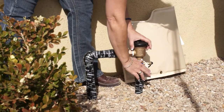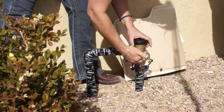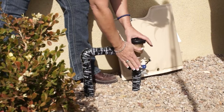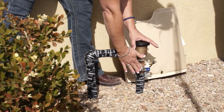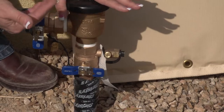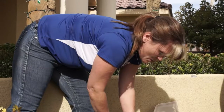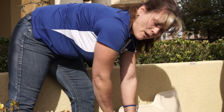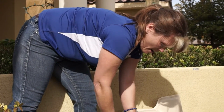If I turn this one where there's a little notch to where it looks like it's cutting this pipe in half, this is off. So if you have a leak in your irrigation, your valve is stuck on, or if it's continuously watering where it shouldn't be, this is an easy way to shut this off. This will only shut the water off to your irrigation without having to go to the street and shut it off.